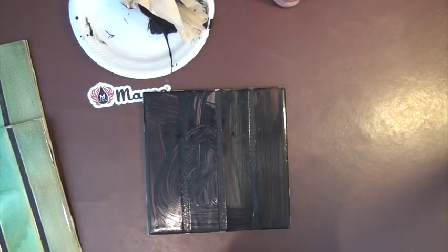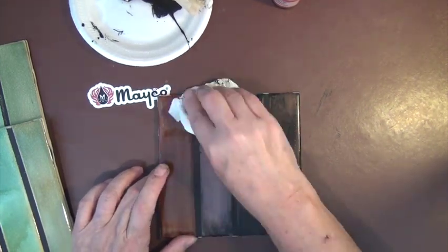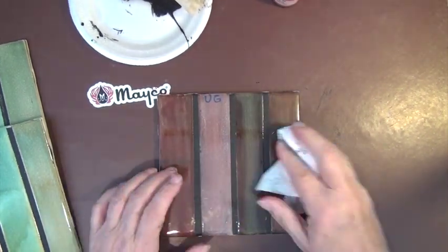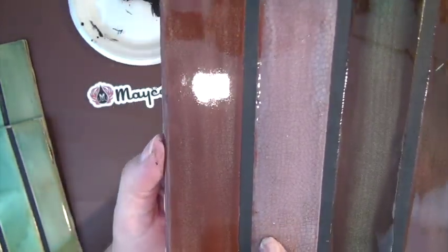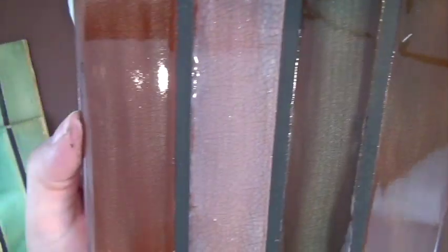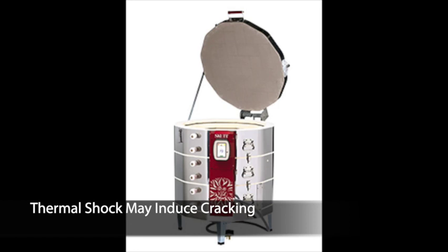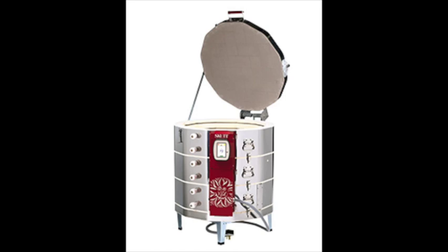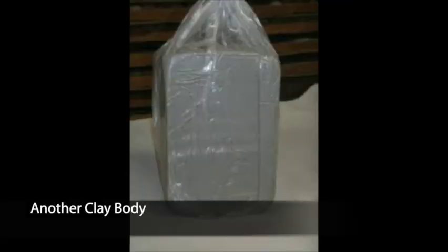Once highlighted, you're going to see a big difference — this is where consumers sometimes think the classic crackles did not work. Sometimes letting the classic crackles sit for a day or two will enhance the crazing or crackling of the glaze; sometimes right out of the kiln it just doesn't show as much, but allowing it to do its job over a couple of days does work. To troubleshoot if it did not craze: you can thermal shock the bisque by taking it out of the kiln a little warmer than normal, or spritz the ware while it's still warm. The clay body might also just fit too well — try another clay body to see if you get the crackling.